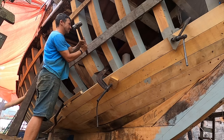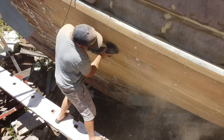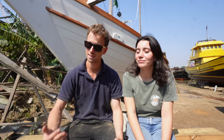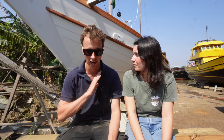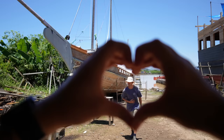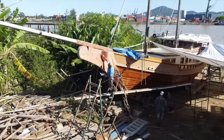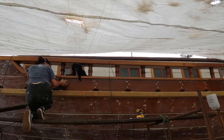Well, of course, firstly, there was building the hull, but other than that, we had to sand the hull, then fairing, with a 36 grit big sanding disc to get the most off. Then we filled all the gaps with some fairing compound before sanding it lightly with the palm sanders, the orbital sanders. Once that was faired, which took forever, we applied two layers of epoxy resin on the entire hull with a light sanding in between both layers.